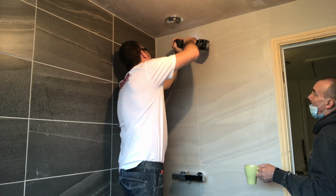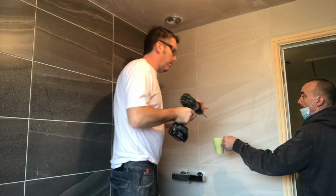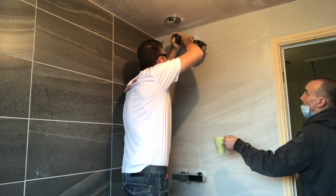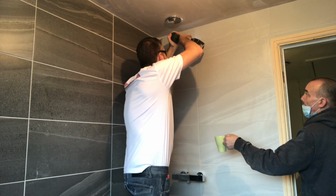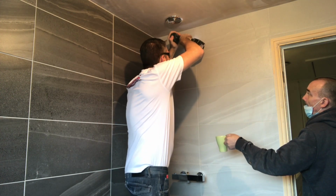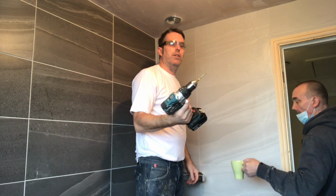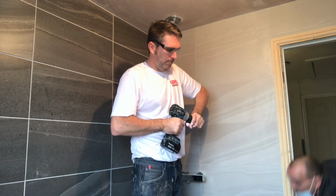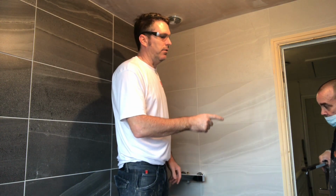Always start on a slant. Wiggle it about. Keep wetting the bit. That porcelain tile, 6th hole, it's drilled, bit still on it. That hand now I'm going to take off. My mate's going to take it off. And we'll use that for ceramic tiles.